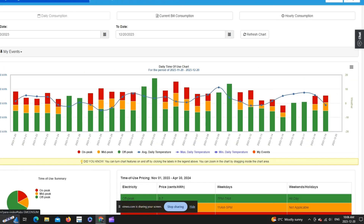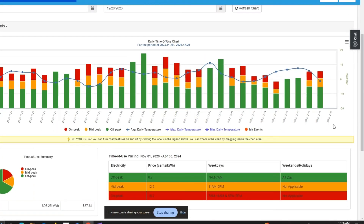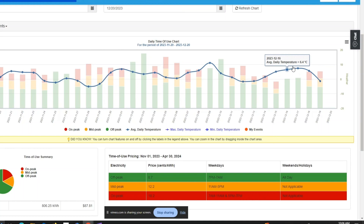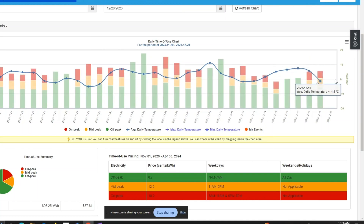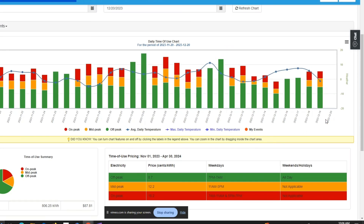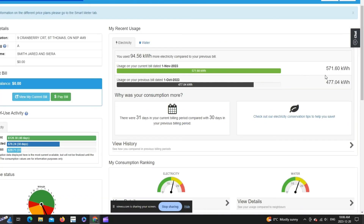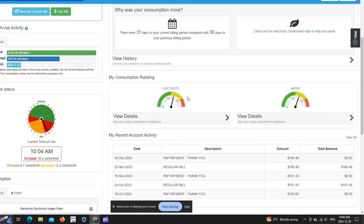This is the breakdown for the month, color-coded based on cost. You can pause here to see how many kilowatt hours I'm using per day — the blue line is the average outdoor temperature. In green and orange I am running the heat pump pretty much all the time. During red, which is my on-peak time at 18 cents per kilowatt hour, I do try to run the furnace more so than the heat pump.